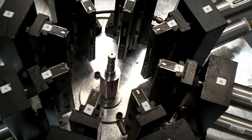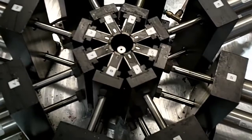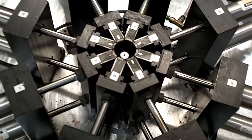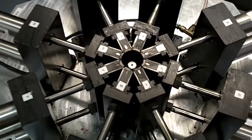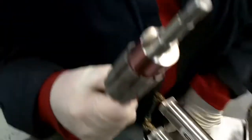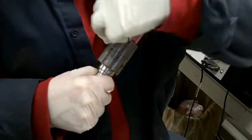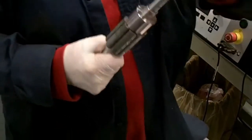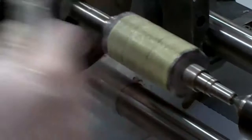In another area of the factory, a technician works on the motor shaft assembly. Here we see how the motor magnets are precisely assembled to the shaft, creating the motor's rotor. The magnets are held in place, allowing the epoxy to begin setting. In a few moments, the assembly can be handled and cleaned by the technician and then will be placed in an oven for additional curing time.